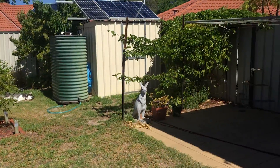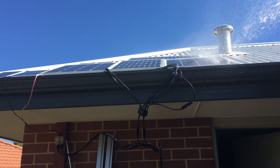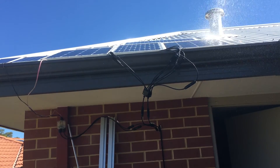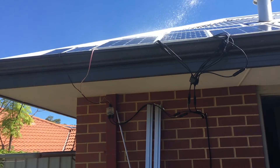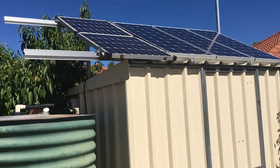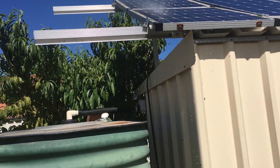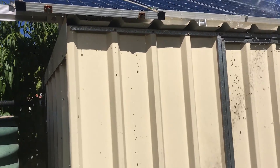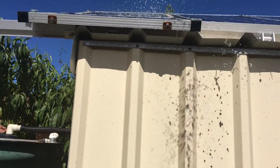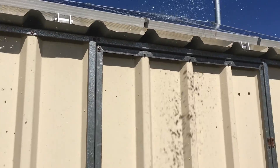Panels don't like it when they get too hot — they drop power. It's not extremely hot but it's 35 degrees Celsius. So what you do is just get a hose and cool them down. It doesn't really matter what setting you use on your hose. All you're doing is putting some water on to cool it down — you can use a little mist.